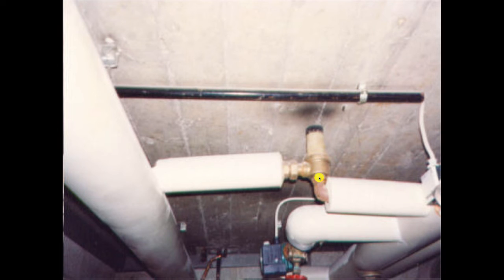And as soon as you felt hot water creeping through here, you would turn the knob back and leave it like on a hair trigger. At that point, it's all set. You can put your thermostatic radiator heads on, and when any one of them shuts down, the flow that's not going through that radiator will flow across here.